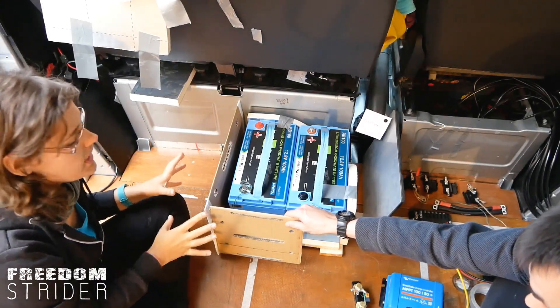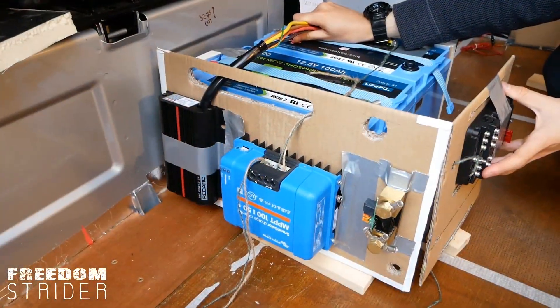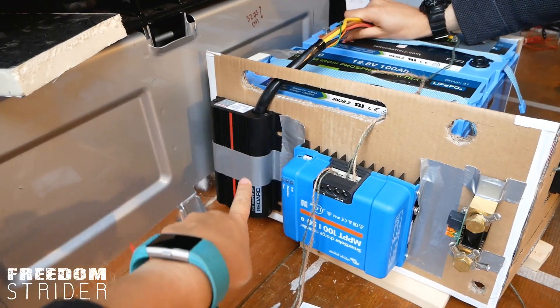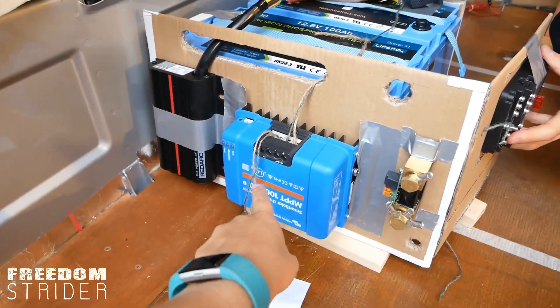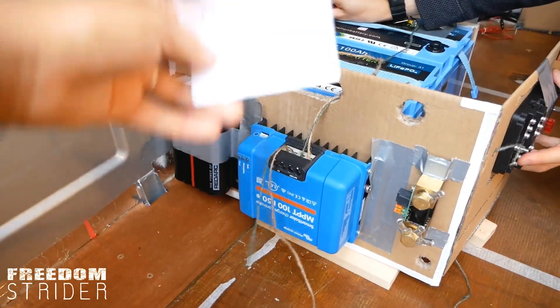So we're just building what we need, hence you see this corner here. This is roughly the mock-up done, except the wiring is not connected properly. This is our DC to DC charger — it is the closest to the front of the van, because just over these seats is our starter battery. Then we have our MPPT charger, which is connected to our solar panels.